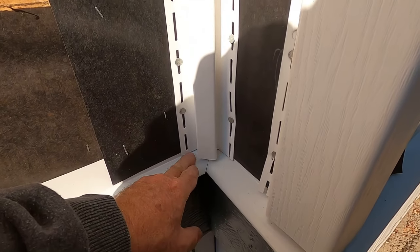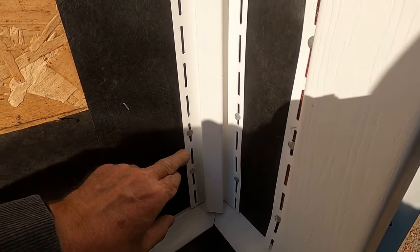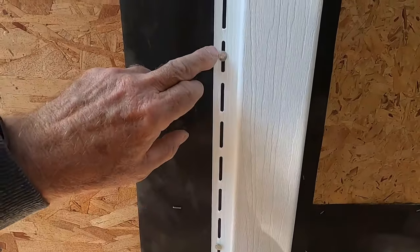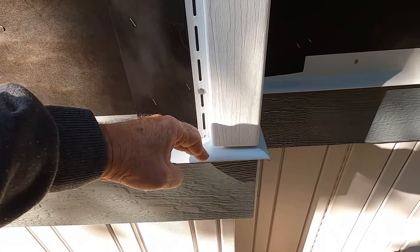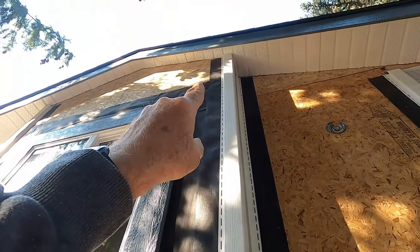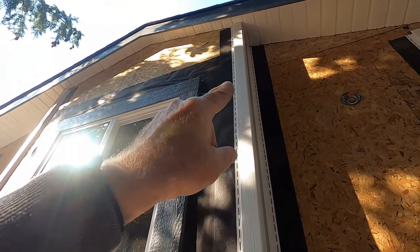When I nail it at the bottom, I nail it at the top of the slot, and then I transition into the middle of the slot. The idea is that it's not going to move down onto my flashing. All movement in this siding — I've anchored it down here — it's going to go up and down and be taken up there. I have a bit of an expansion joint up in there, about a good eighth of an inch where the corner meets the soffit, to allow for expansion and contraction.